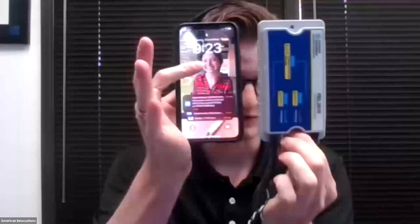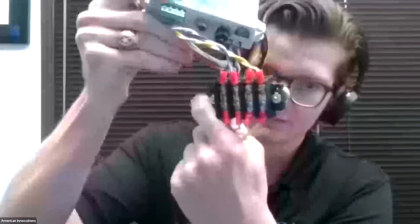Here's our IO module — it fits in the palm of your hand, very easy to install. And our new relay, the 2510 — just to show a comparison, it really is about the size of an iPhone, a very accurate comparison. These leads are potted inside the IO module and go into the terminal blocks, which will take the brunt of any surge. All in all, a very compact solution.